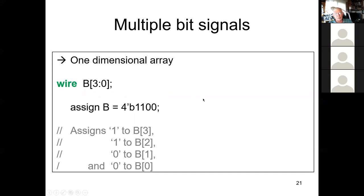A wire has to be driven at one end, and if it's not driven then it has no value and shows up in simulation as an X. These signals can take on one of four values: zero, one, high-Z, or X. One is true, zero is false. High-Z means it's disconnected. If it's driven by a gate whose output is unknown, it can have a value of X.